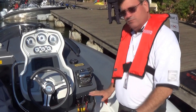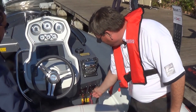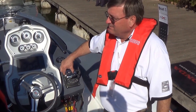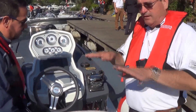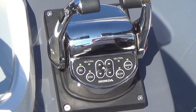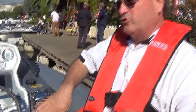It gave me an error, because it said, wait a minute, what are you doing? Of course, we have master trim — just one button — or individual. Why would you trim them individually? Sometimes the boat will ride off, especially boats that don't have trim tabs. This one doesn't have trim tabs, so some bigger boats will have trim tabs you can do that with. But if it doesn't have trim tabs, you do it with motor trim.